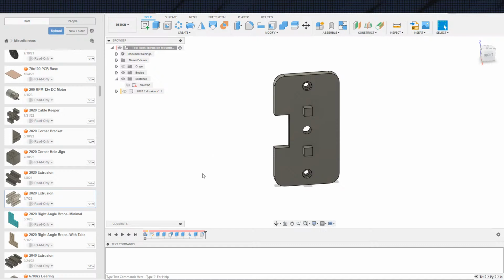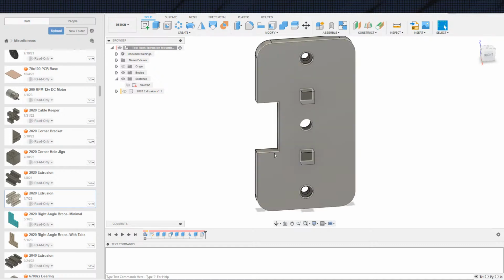Assuming, I should say, the radius is going to be dependent on the size of this cutting tool, technically speaking. So if I used a smaller cutting tool to get into the corners here, I could make them tighter, a smaller radius, but I'm not going to bother worrying about that. I will use a larger cutting tool to begin with.